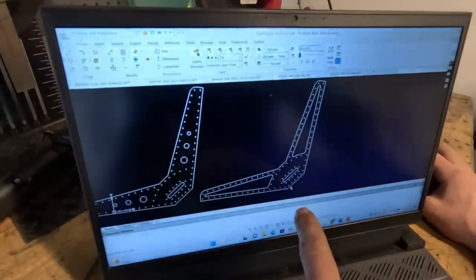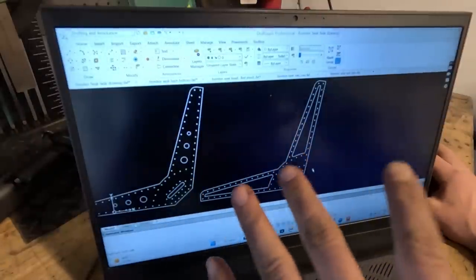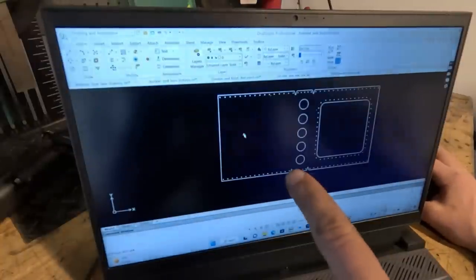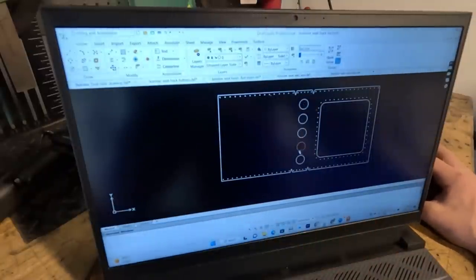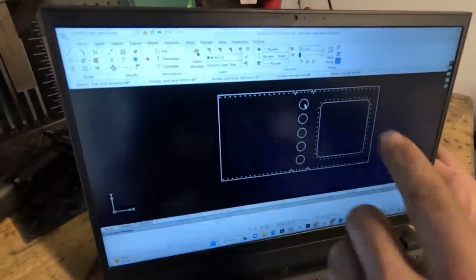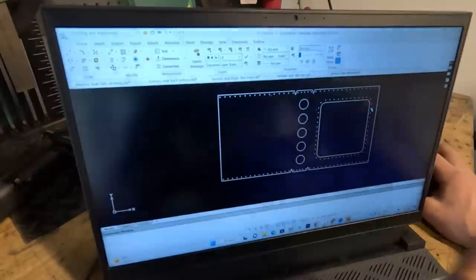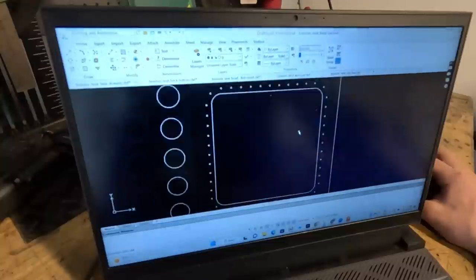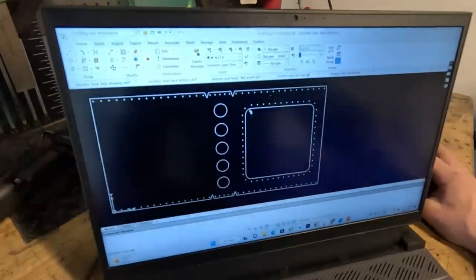We've got this kind of angled back section here at the bottom. These are roughly taken off the seats I built for my hot rod, but here's the rest of it. So basically this will be the bottom. There's nothing special there. There's gonna be a pad. And then that angled area I was showing you guys is gonna be 2 inch holes, dimple died. And then we've got this cutout here. Now what I'm planning on doing, and this is what I did with my other seats, is that this area is where we would do some cool bead rolling, right? And then you just rivet that piece in.